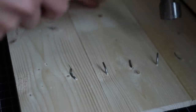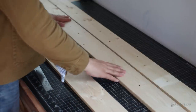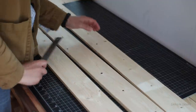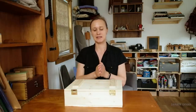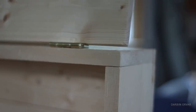Since we're not using any glue, I'm going to use a hook technique to hook the nails in on the side to hold the lid together, which is a neat little trick. When it comes to making a box, the size should really be determined by the wood you have to work with and what you're planning to put inside. Just make the box a good width — two, three, or four boards wide. I'm using butt joints here, which means the pieces are just butting up together with no actual joinery; the nails are attaching them to each other.